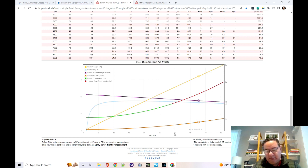I have pictures to prove I was pulling just around 30 amps, which is what eCalc is showing. Before it gets to 30 amps it starts overheating. I held throttle up there for maybe two or three minutes just wanting to see how fast it would fly at full speed — and that was enough to burn the motor. Now look at what that chart looks like: just under 30 amps — maybe 28.5 or 29 amps — it shows in the red.